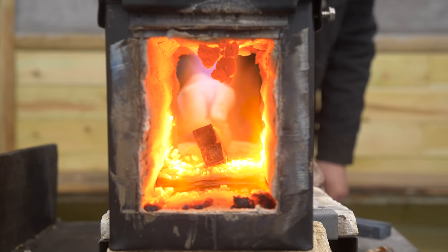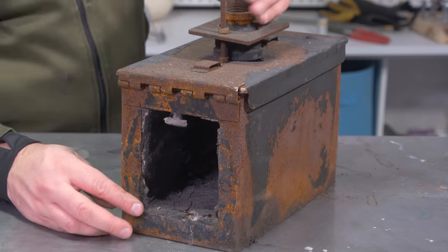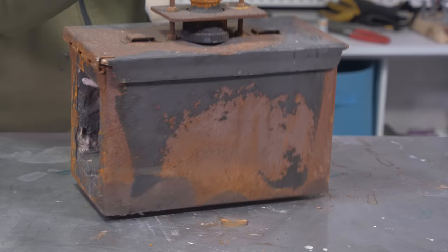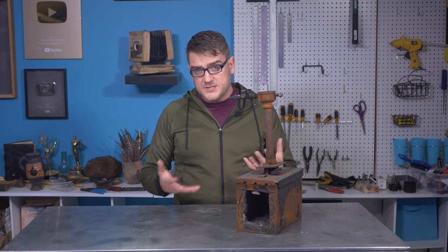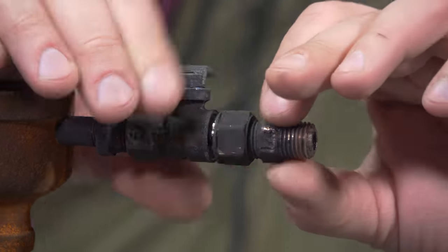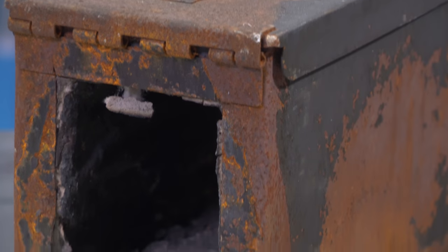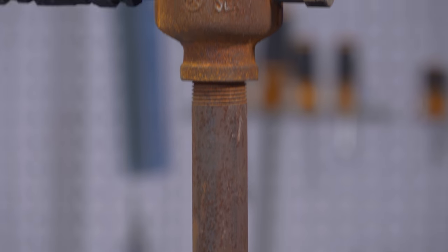It basically shoots propane, mixes it with air, to produce a high flame, and the whole thing is designed to operate at a pretty high temperature, so a lot of the main components of it haven't really been too damaged. It's a lot of the more outer things that aren't supposed to get quite so hot that will just need to be replaced and repaired. Some issues we're facing are that the hole's burned off. A lot of the mechanics here for turning it on and off are probably not quite the greatest. And then the whole thing just rusted, mostly from probably the firefighting after a lot of the protective oxide on the outside of it burned off.